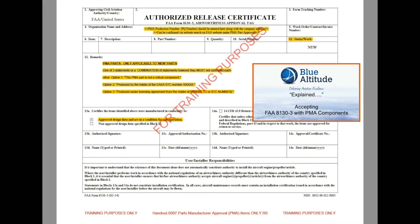Firstly, what you should be able to understand is this. In Block 4, you should be able to recognise that there will be what we call a PQ number. That PQ number is specific because it's the approval number issued by the Federal Aviation Administration. If you did a bit of research and went to the FAA website, that PQ number would be allocated to that organisation and would confirm whether they can actually manufacture that part or not. So it must have a PQ number, and that would aid you with traceability. You would search for the part number on the PMA portal under the FAA website itself.